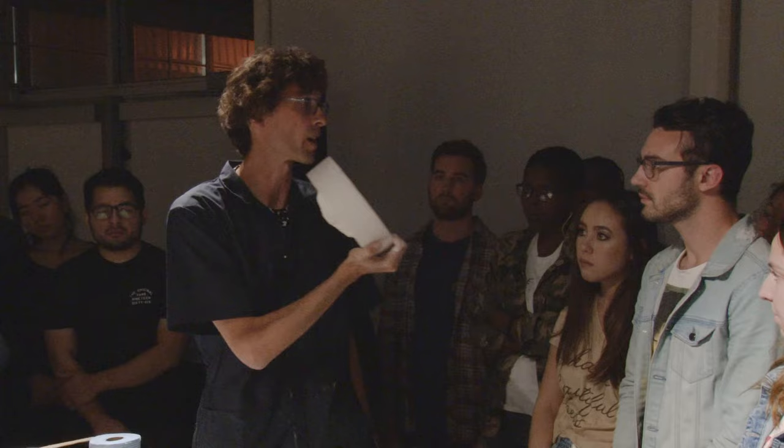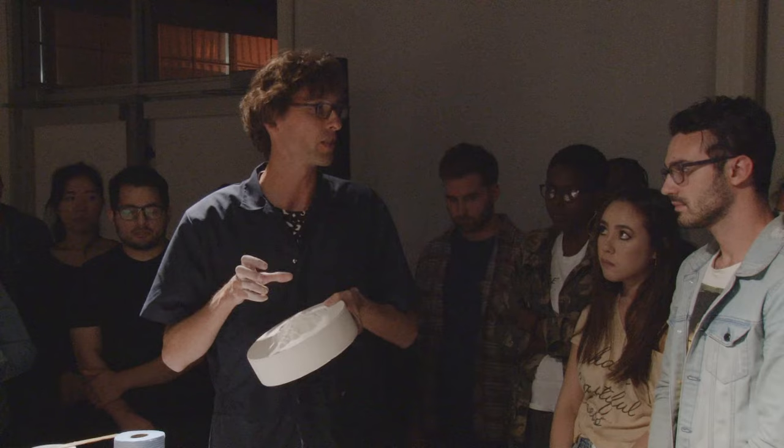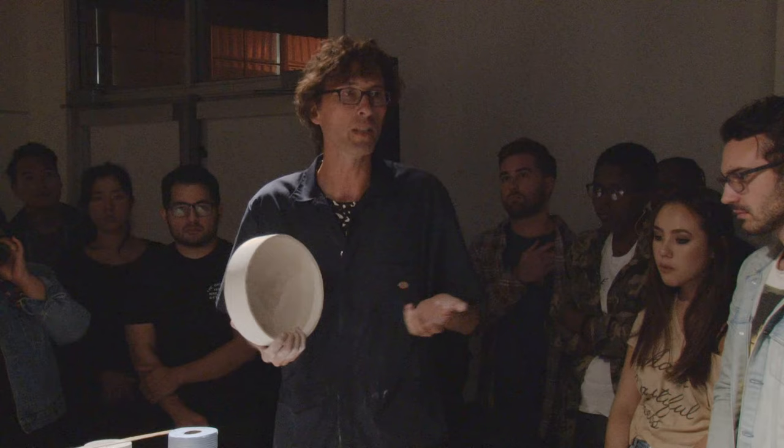So the nice thing about this process is it's almost exactly the same thickness everywhere, which is pretty awesome. Let's say it helps you counter one of the inherent problems of working with clay, which is that there's always the possibility of having differential shrinkage, which makes for basically catastrophic failure, right? Things just break. Whether they break while they're in your hands and you're working with them, or they break in the kiln when you're firing them, they break, and that's not so fun.